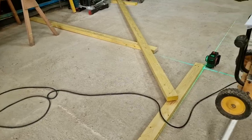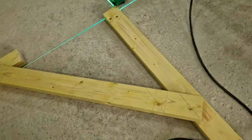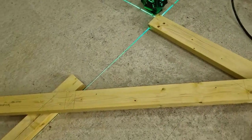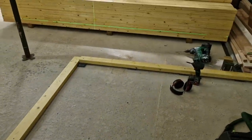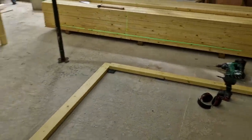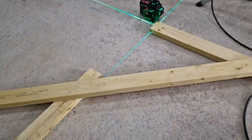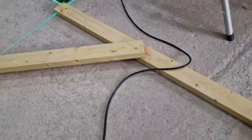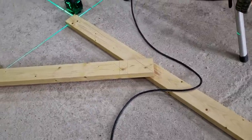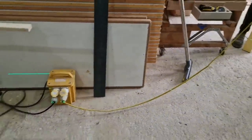I'm setting out the corner here. I've made the sole plate and marked it out for a typical door — this door only needs to be narrow because it's kind of the door to nip out of here into the shower room. There's already a door to come into this area from the side where the TV and sofas are going. I've set the sole plate out and now I'm doing a little bit of mathematics based on roofing to decide how far from the corner to cut those legs to give me the exact space.